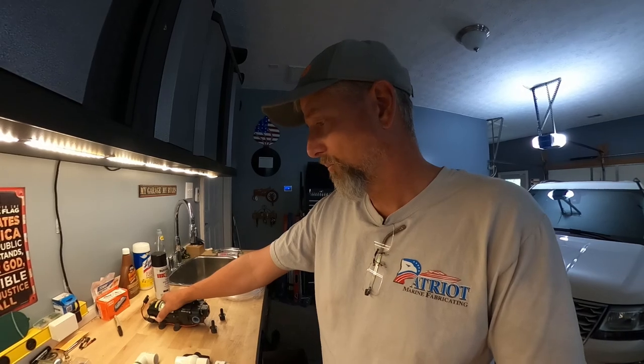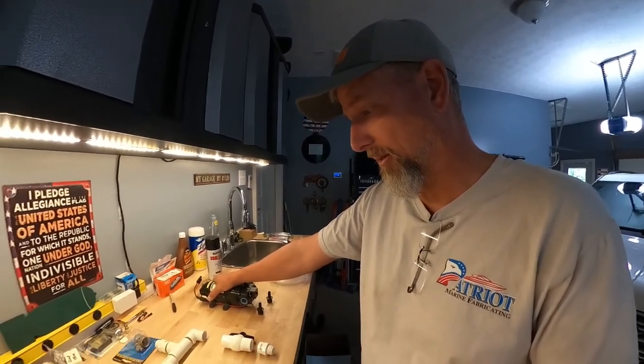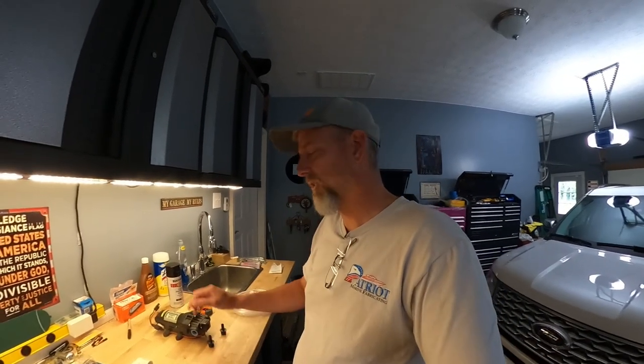So I got 60 gallons of windshield washer fluid, negative 25, that we'll put in the tires, but I need to build one of these first. There's a chart on the internet. If you just go out there and look for how many gallons does it take to fill up a tractor tire or whatever, it'll come up. And there's some good videos out there from other people, but I just figured I'd expose my audience to filling the tractor tires since I need to do it anyway.